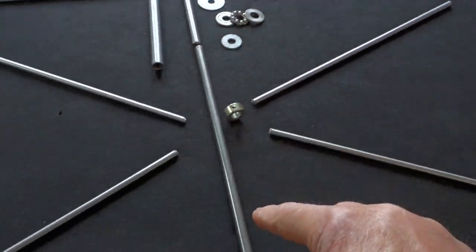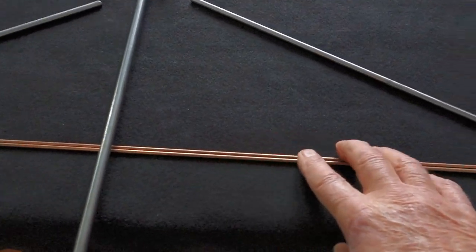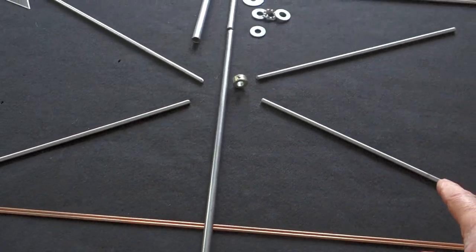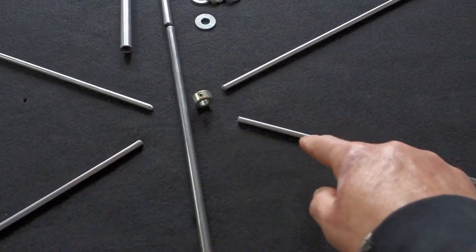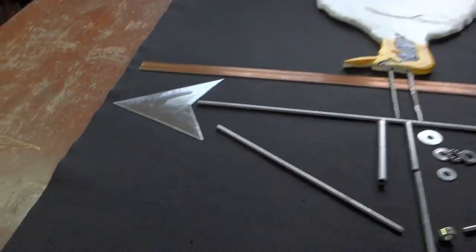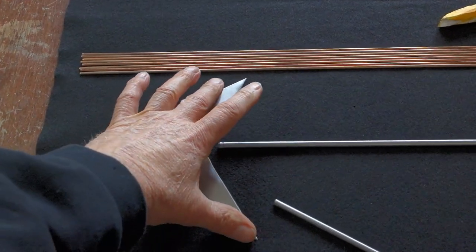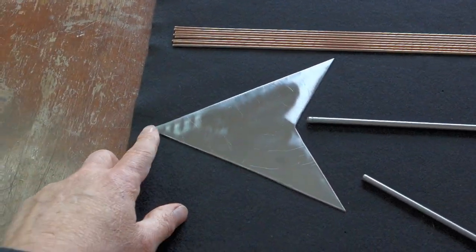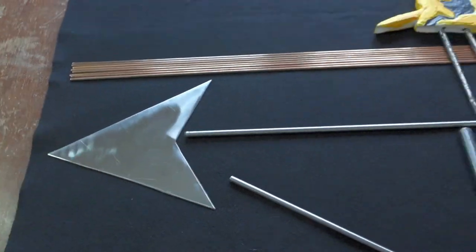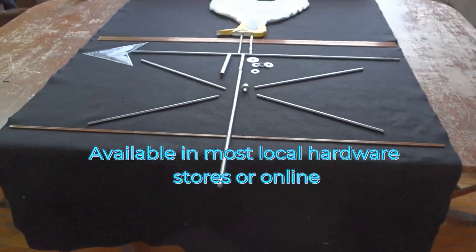This is three-eighths cold-rolled steel. This is RG45 — these come in 36-inch lengths, going to be cut in half, so I'll have four pieces 18 inches long, and they're going to form the scroll on the direction pointers. This is 18-gauge steel, going to be six-and-a-half inches point-to-point, seven-and-a-half inches from this point to the outer points. That's everything you need to know — and here's your shopping list.